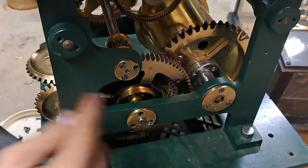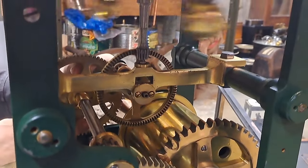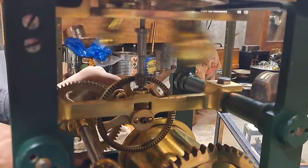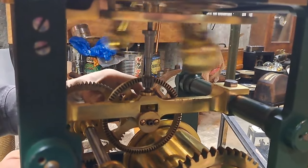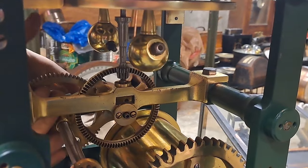to pull the cable up this way on this side. You see that? The governor balls, the weights fly up, and they rub on that friction pad up there. And if the brake material was in, which I have to renew, which I'll do shortly, it wouldn't scrape metal to metal that way, but that governor, you see, keeps the speed regulated.